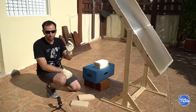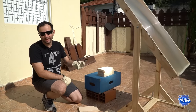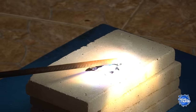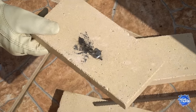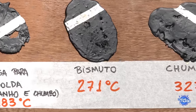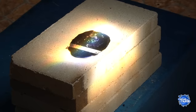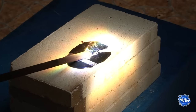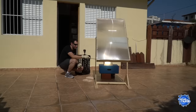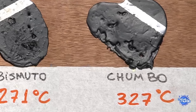Next, a lead alloy with tin — this alloy is used in soldering electronics. Its melting point is 183 degrees Celsius. If this thing melts, that means the lens has reached 183 degrees. It melted — like, in a second. Bismuth — I'm even sorry to melt it, 271 degrees Celsius to enter liquid state. This thing is so beautiful when it crystallizes, but in the name of science, the bismuth turned into a puddle of molten metal. Lead — 327 degrees Celsius — look what's left of it.